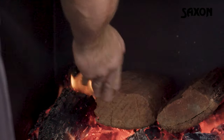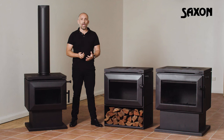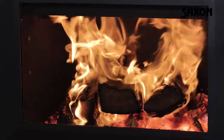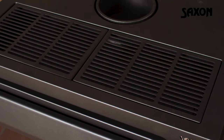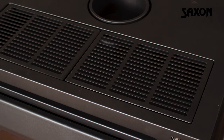When the air slide is moved to low or the door is opened, the fan will switch off, helping maintain firebox temperatures for a longer period of time. After 20 minutes, when the air slide is moved to high and the door is closed, the fan will automatically switch back, ensuring the firebox hits optimum temperatures before cool air is forced over the firebox and into your room.